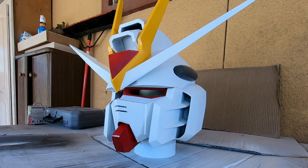I want to pause and explain what happened. The solder came apart on both sides. I was putting too much pressure when putting the front piece in, and that's because I didn't solder it deep enough. I kind of just did the top layer really lightly and there's no strength in that, so that's why they separated. Off camera I fixed it later and repainted it.